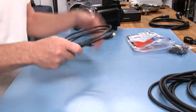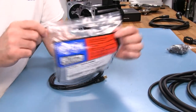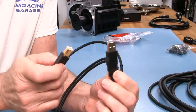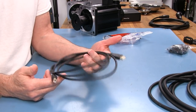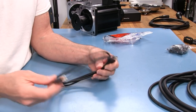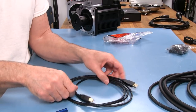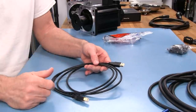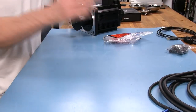Let's talk about the USB cable that comes with it. This is a Triplite cable, which is one of the better USB cable brands out there, with gold-plated ends on both the USB-B and USB-A connectors. They actually tested cables and found one that met their standards — great that they went to that extra effort. I would still like to see ferrite chokes on both ends for EMI, which I'll probably add myself. You can buy a sorted size kit for about 20 bucks with around 50 chokes.